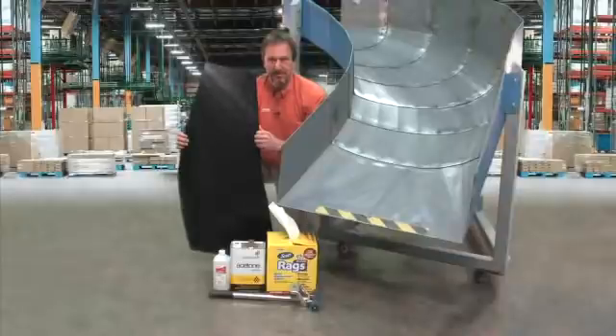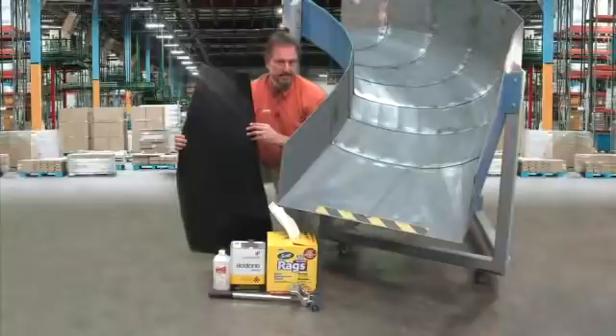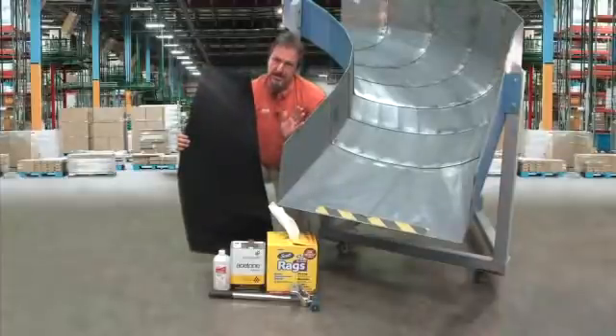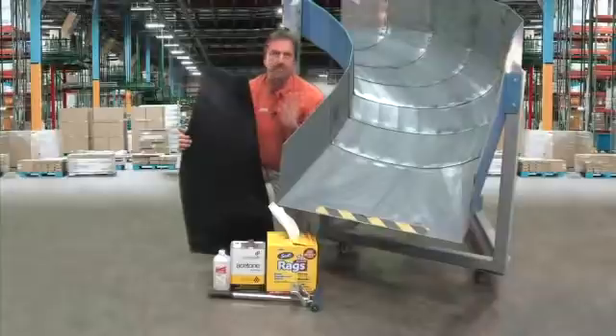Now what we're going to do in order to solve the problems that you just saw is we're going to line this chute with our DuraSurf STS, which is a silicone enhanced UHMW material with an adhesive backing. In order to do this there are a few things that we are going to need. The first thing we're going to do is prep the surfaces of the chute. Obviously in a lot of cases there's been a lot of chute lubricant in these chutes — sometimes people are spraying Pledge or who knows what in there — and we've got to get that cleaned out.